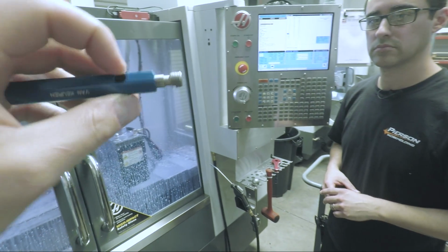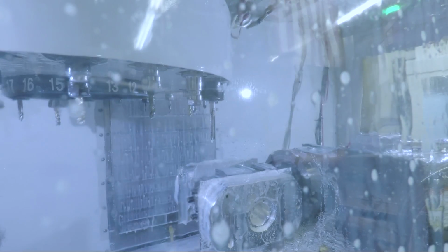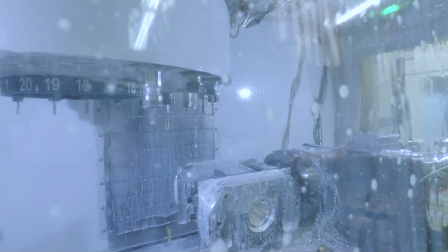And the way this works is you've got a min and a max of the cutout. Watch this drill. Oh, it's okay. It's just going to chamfer everything it's done to give the NPT tap a lead or a chamfer. Yep. So here's a long drill. Cool.